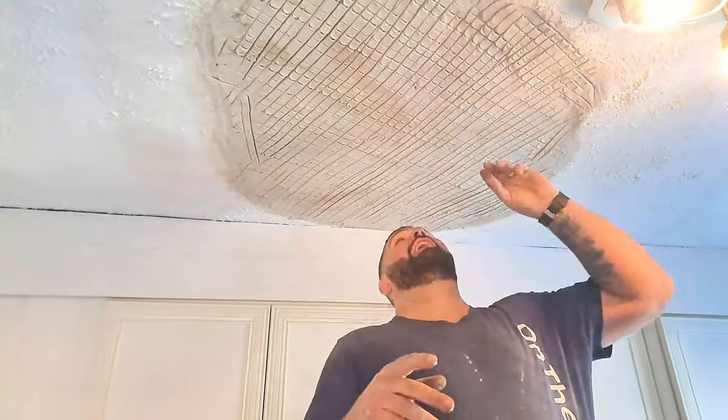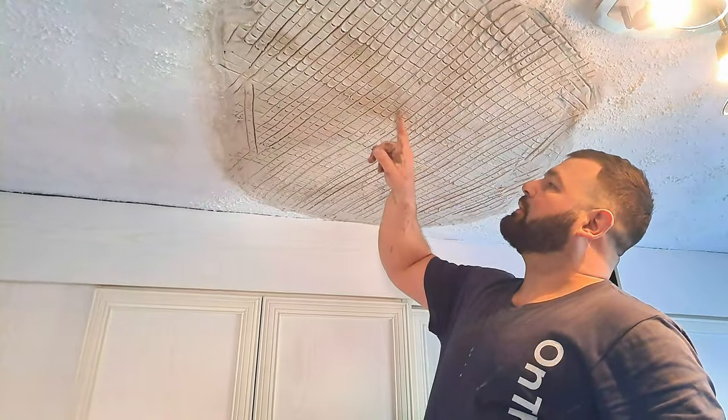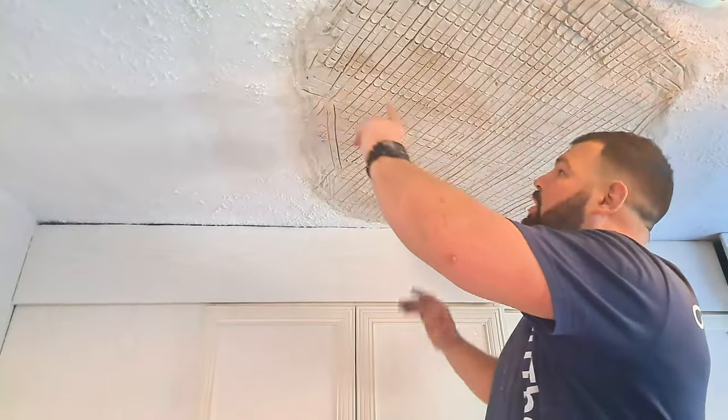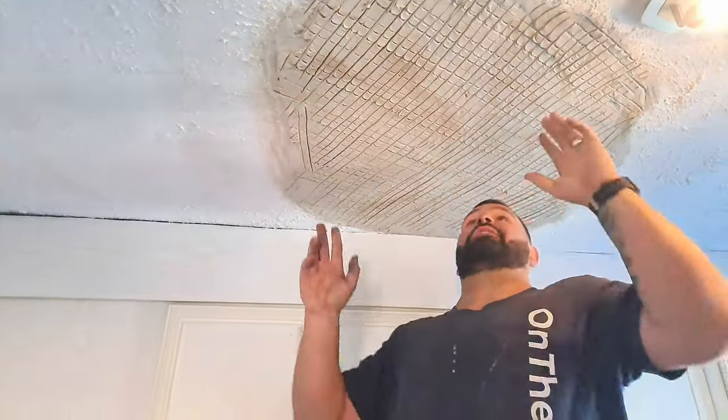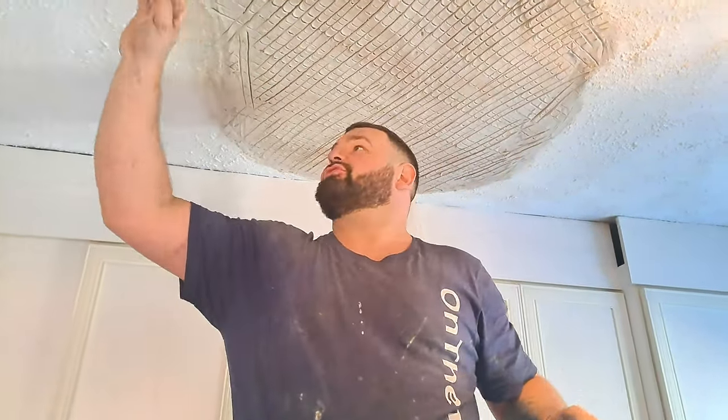Adhesive flash sets. So when you're finishing plaster, it sets slowly over time. Adhesive just goes off. So these bits are set, these dark bits, and the bits next to it are still wet. But I know as soon as you start getting dark sections, that within 15, 20 minutes, that whole thing's going to be set. So now we know that that's nearly set, we're going to start mixing up some bonding coat and we'll get this built down to the right level and see if we can't match this pattern a little bit.